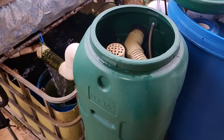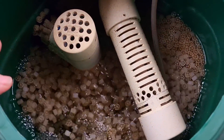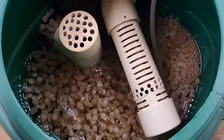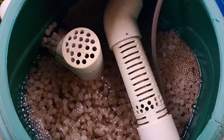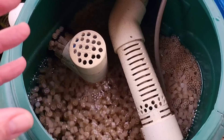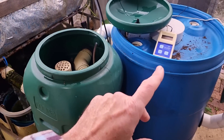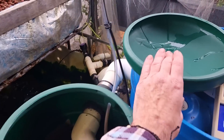This one here has under a three-minute retention time. Air-wise, as long as you can keep it at a rolling boil like that, you're pretty much good. You don't want it moving too fast because it will knock all those bacteria off — just want it rolling a little to get air through so all the bacteria have a chance to get some oxygen. It also helps knock off any loose solids, because you will find some fine solids make it through your radial flow settler into the moving bed bioreactor.